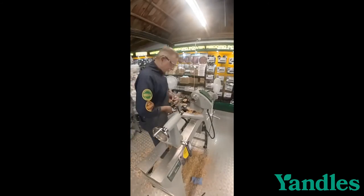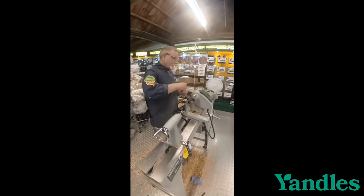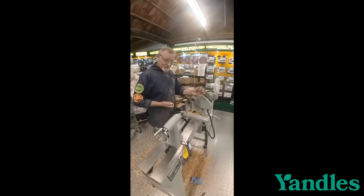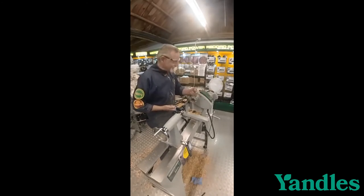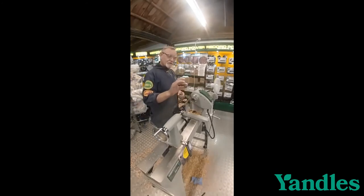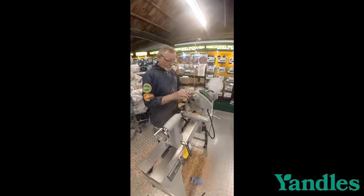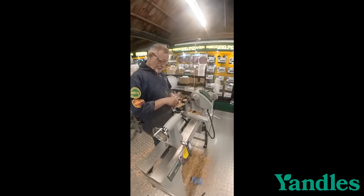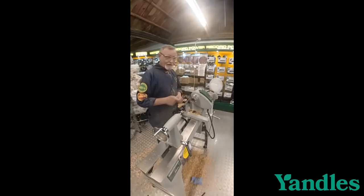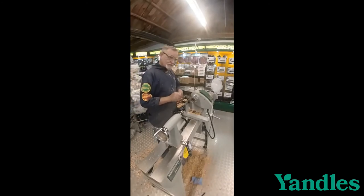Who's got the Axminster 3/4-16 threaded live centre? Anyone seen it before? Yeah, okay. It's wonderful. Throw it away. Quite honestly, I don't know why they've done it. I'm sorry, Axminster. You've got different tips that fit in and they've got a slight taper. I don't know which taper it is, it's one of the tapers. It just fits in. And then you've got this bit, and this is purely so that you can rotate it and force the taper out. But the thread is 3/4-16.